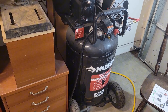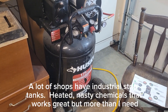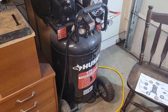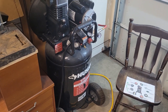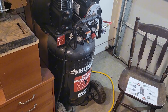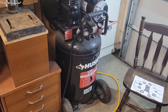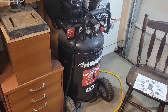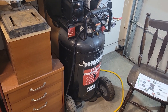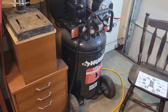I'm using a quarter-inch hose line, and I think the pro guys use three-eighths or half inch, which blows a lot more air and can blast even fresh powder coating off things. I'm dealing with rusty items where the paint and powder coating is all chipped and nasty — it blows off really easily, and even the deeper rust pulls right off when I'm running the sandblasting cabinet. So don't listen to those guys saying you have to have something huge. I bet even 26 gallons or 22 gallons could work; 20 gallons might be getting a little low on CFM. But 30 gallons works perfectly fine.